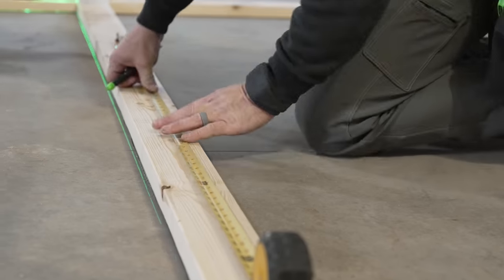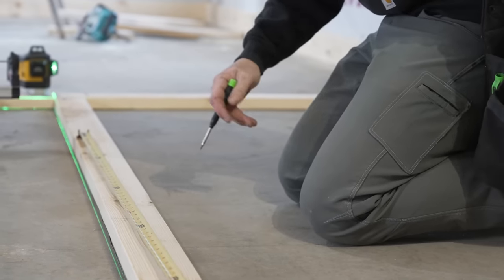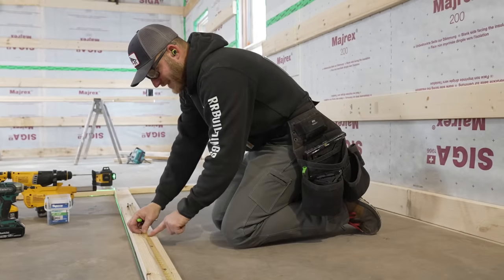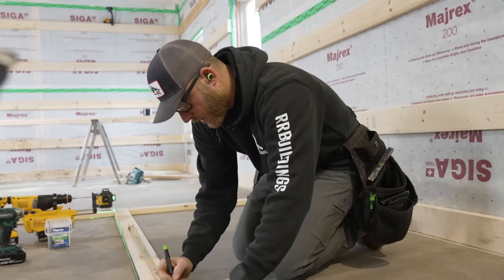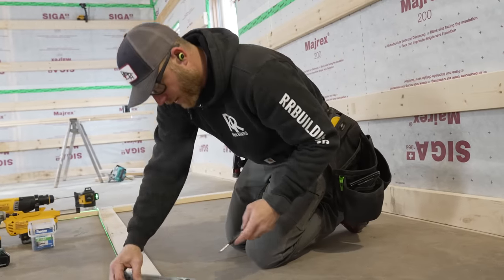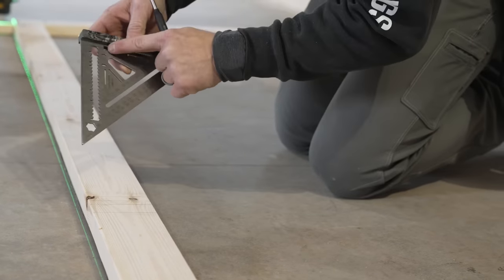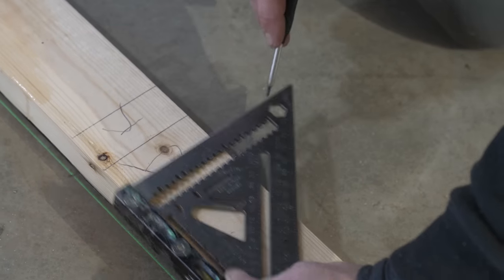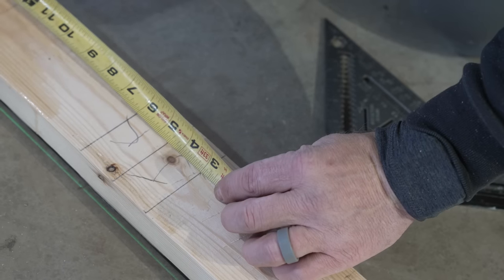Here's a great example — I want to go from a center point and get a door frame. This is my center; it's a 38-inch rough opening. Instead of going 19 both ways, I'm going to set it at 29 — that's an easy mark at 10. Then I add 10 to my 38, which is 48 — now I've got exactly what my opening is. With my Martinez square I line it up with my mark and I can get a perfect inch-and-a-half spacing for all my layout. Once you get your first mark, you just slide it over to that inch-and-a-half mark. Jack and king stud — ready to frame a door in.